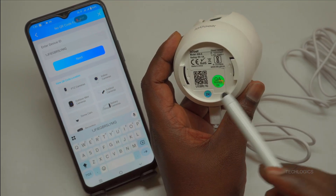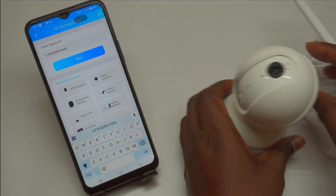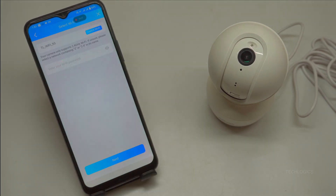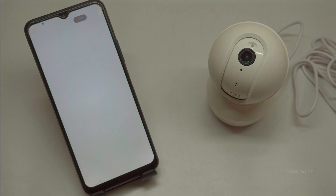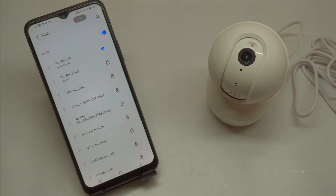Demo note: in this video demo, the app couldn't recognize the QR code due to poor lighting or angle issues, so we selected the No QR Code Found option at the bottom of the screen. This unlocks an alternative manual method — a new field appears asking you to enter the Device ID. Look for the 8 to 12 digit alphanumeric ID printed next to the QR code on the same sticker. Type it exactly as shown, case-sensitive, then click Next. This bypasses scanning entirely.